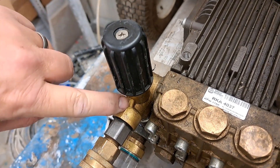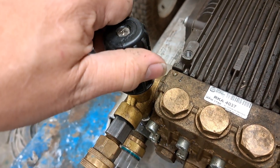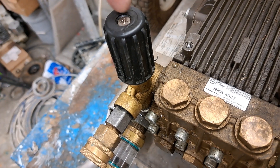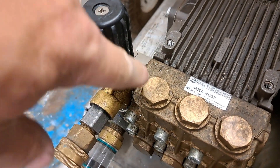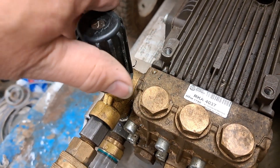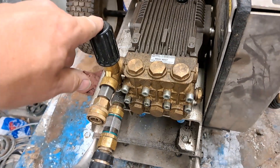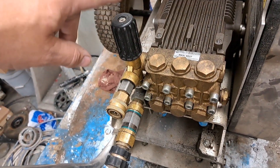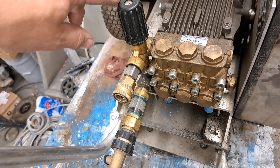Found out that the customer said it was leaking. They had tried to make an adjustment to it and they didn't tell me this until after the fact. Apparently this thing is screwed down so tight that you can't even turn it, which is why it increases the pressure — it increases the resistance on the unloader so your pressure will rise. This is why taking it to a certified shop is always the priority. But in a jam where you can't do that, it's always best to have a pressure gauge, and as I tell you in my videos, when you go to adjust these, you adjust in small increments from low to high — not all the way up and then work your way down.